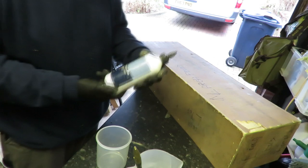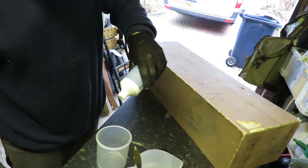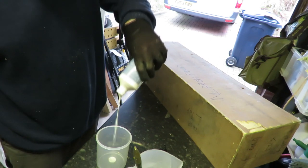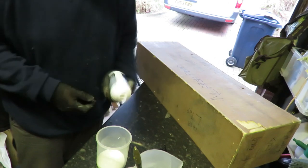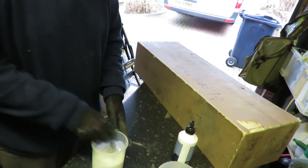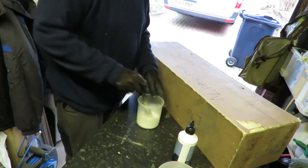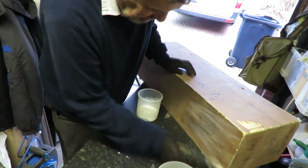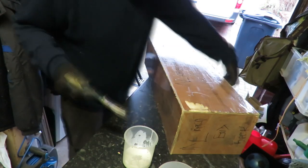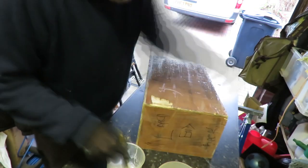The boxes are in a bit of a state, covered in marker, and there's a couple of holes, a bit of wood missing. I'm not going to bother filling that in as these are going to be hidden away under the seat boxes and inside cupboards, so you're not really going to see them. All I want to do is tidy them up, so first I'm going to give them a coat of what you could call size — a 50/50 mix of PVA glue and water. This just seals the wood and stops it absorbing the paint. I'll give it a generous coat and left it overnight to dry.